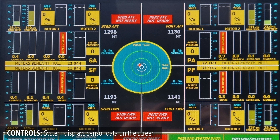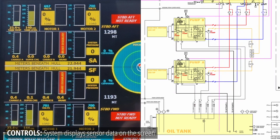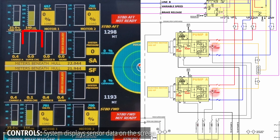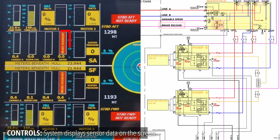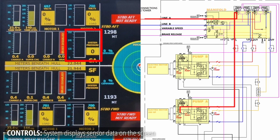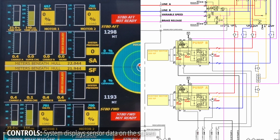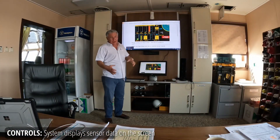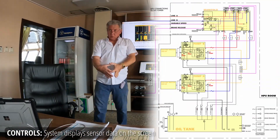Most of you have seen it. If you look at the charge pressure on each pump — this is the charge pressure on one pump, this is the charge pressure on another pump. This is the supercharge pressure pump, this is the brake pressure, this is the working pressure which we call system pressure, and the command from the joystick in metric tons. We also deal with the tank — the centimeters in the tank and the temperature in the tank, the percentage of electrical current, the percentage of full load amperage, a graphical display to help you see, and the voltage as well. This is a snapshot of what's happening on that one HPU, designed for you to glance at it, make a decision, and keep going.